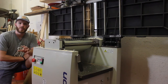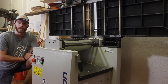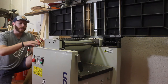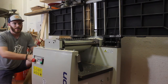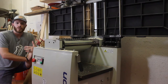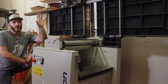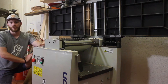A common question about combination machines is whether you have to disconnect your dust collection hose when switching from joiner to planer. The answer is yes and no — for shorter operations I can get away with just leaving the hose attached and flipping into planer mode. The hose is sort of in the way but for just a few pieces to plane down to thickness it's not that big of a deal. For longer operations where I'll be at the planer for 20 to 40 minutes, I'll take the time to bring the hose around to the other side so there are fewer kinks and it's out of the way of the outfeed bed.